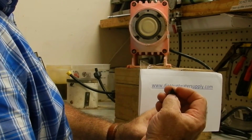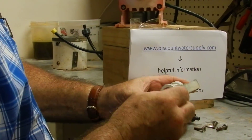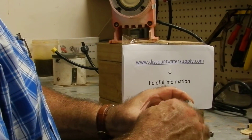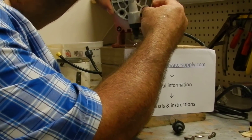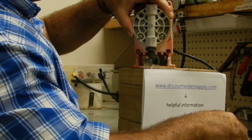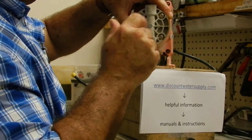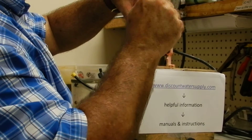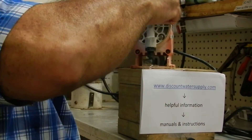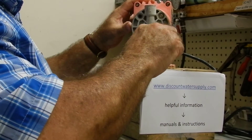In the cylinder head, place your new univalves. In the bottom, the arrow always faces up — this points up, like an arrow. Press the bottom one in so it sits flat. Replace your tube adapter, then put it on the pump. Hand-tight is good enough — don't use power tools. The sealing surface is the outer surface of the diaphragm, so as long as we're compressing that piece of rubber, we have a good seal.